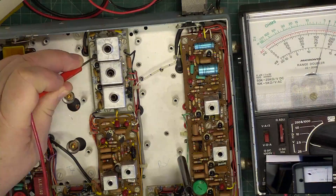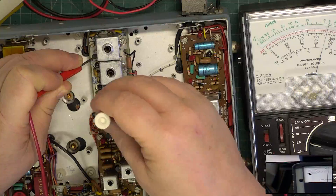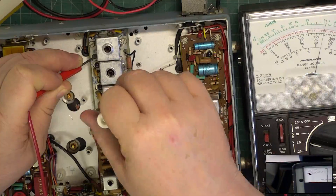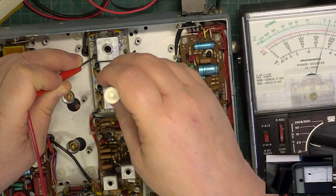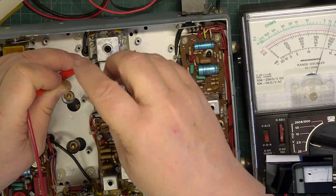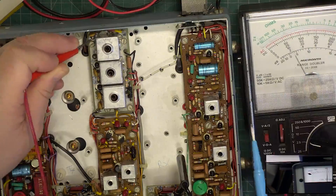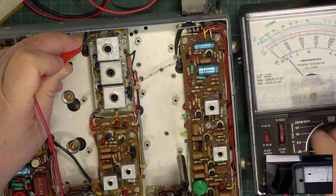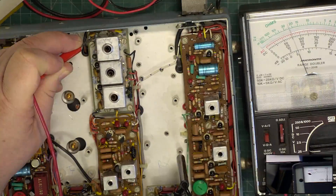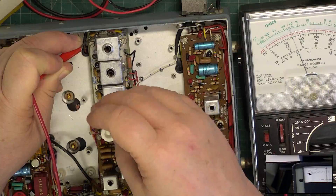Test point one is there, and it tells us we want to get peak from this coil. You can see it dropping - and there's the peak. Then it tells us we want to get dip on this coil - and dip is there. Then we go over to the next test point, and it tells us we want peak. Then it tells us to go for peak with all three on that test point, and then it's going to be very, very delicate.